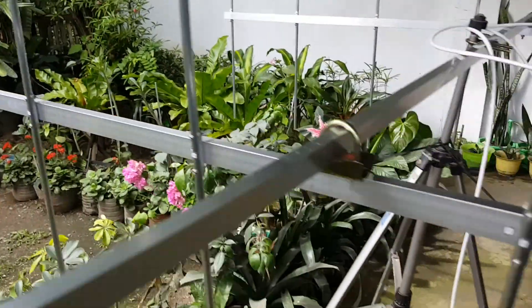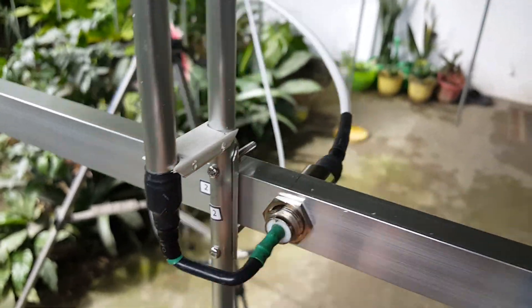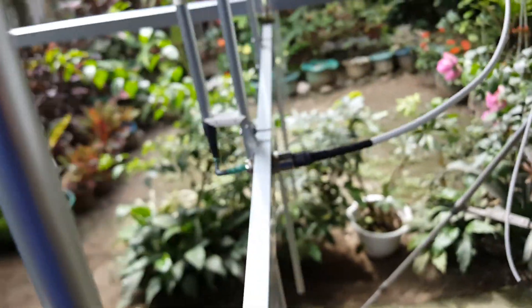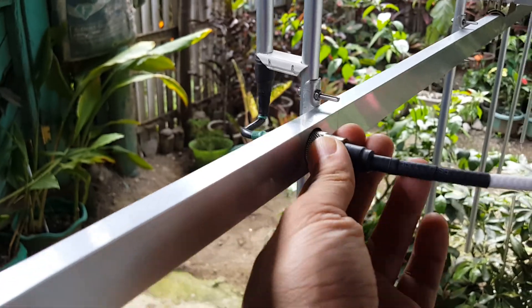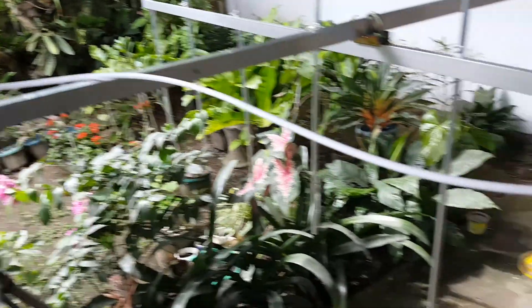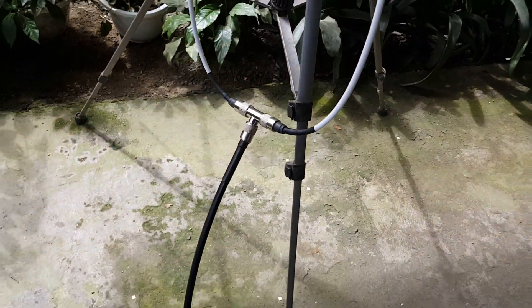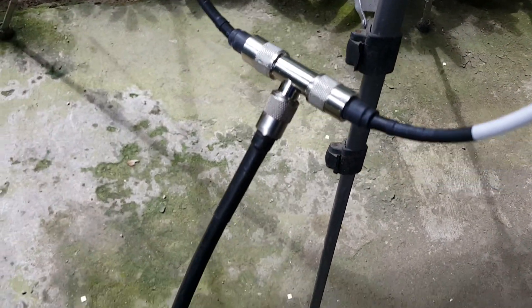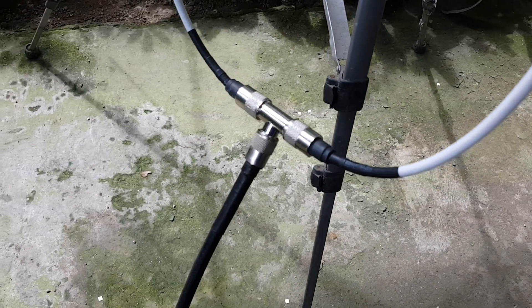From one to seven. Make sure that you tighten the nut on the SO-239 — that's our feed point — connected to the PL-259 connector attached to the phasing harness on both sides, going to the T-connector. This is now attached to my N121SA antenna analyzer, so let's check the frequency response of the antenna.